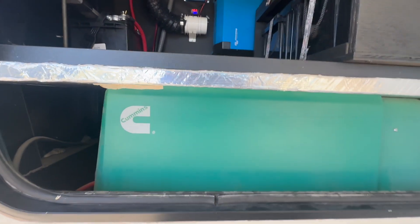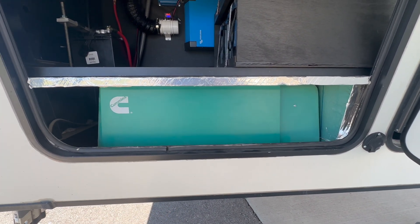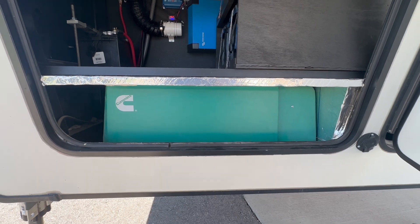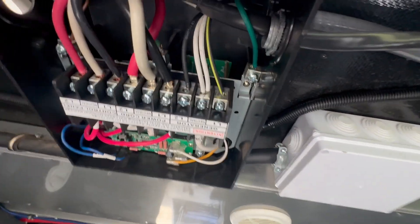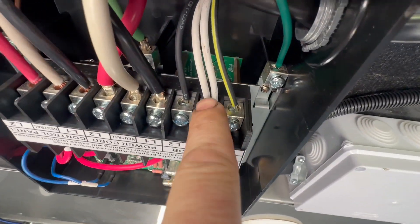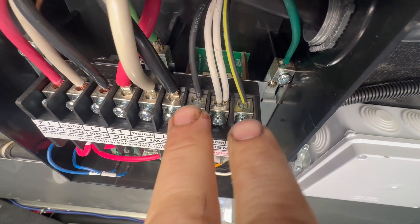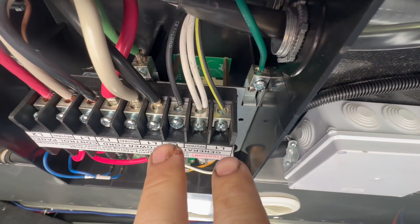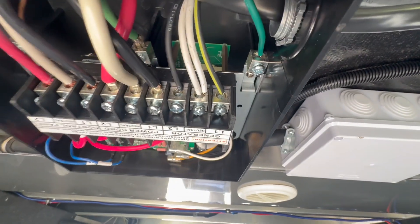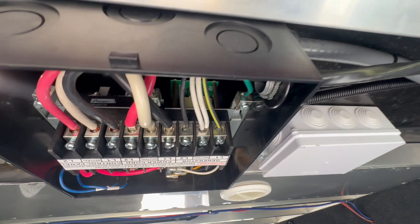Let's say you've got a typical Cummins Onan generator. What you're going to find is there are two legs, but they're in the same phase. Here's the transfer switch — you've got your two neutrals and a hot and a hot. What you'd expect is 240 volts, but really what's going on is it's 120. There are just two legs of 120 and they're in phase. We're going to start the generator up, and this is what you want to do to find out if this is the problem for you.